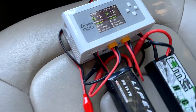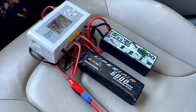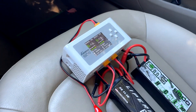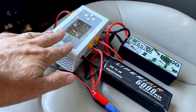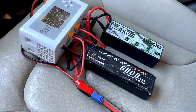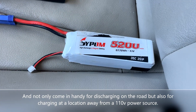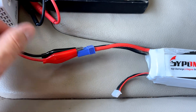Today I had some speedrun failures and I had two completely charged packs. I discharged them at home for about an hour, but everybody should have a charger that has a DC input. This Gens Ace IMARS D300 charger has been excellent — I love this thing. It has a DC input, as does my Ovonic X1 charger, which is very similar but not quite as nice. What I do is plug in an extra 3s or 2s battery pack into the DC input of the charger — this is just a side pack that was sitting around at storage voltage — and the connector comes with two alligator clips, so I just connected the alligator clips to the EC5 connector and it's powering the charger.